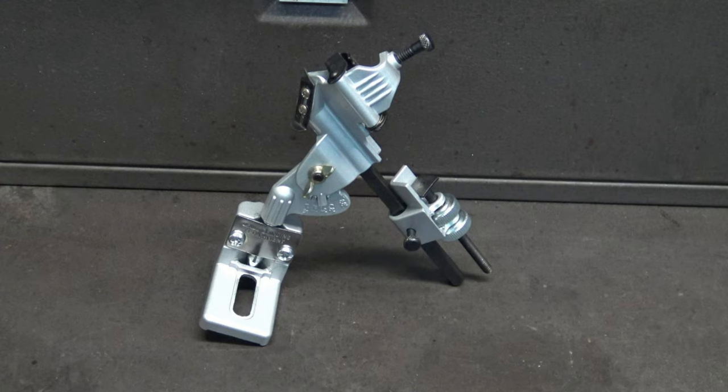So it looks like over the years the drill bit sharpener has always been the same, but the instructions have changed. If you have an older one, you probably already have the right instructions and you didn't have to go through what I went through to figure it out. Overall, I think it's a really good sharpener, just as good or better than some of the more expensive ones. The only thing I would change is I'm using 80 grit sandpaper on my belt sander, and I'd probably change to 100 or 120 for a smoother cut.